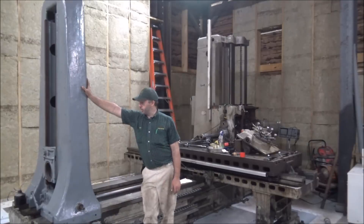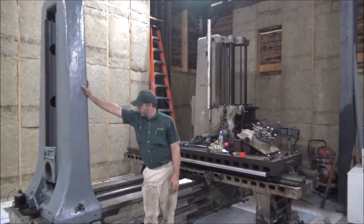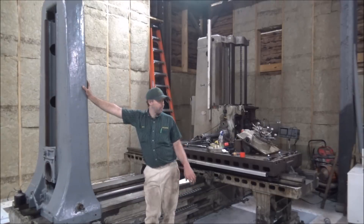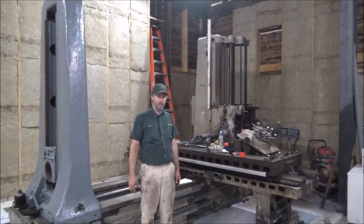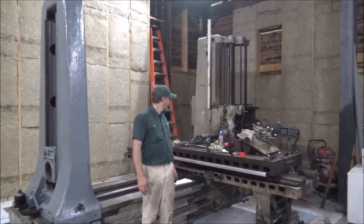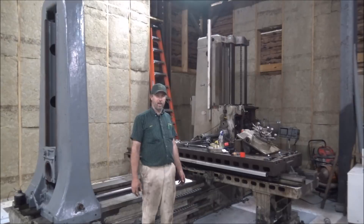I have to say I like the way it looks with the tailstock on here — it definitely gives it more of a proper boring mill feel. Now I've got to find some big pieces of steel to make some boring bars out of. I need like some four and five inch diameter bars that are ten foot long to build boring bars out of, put cutters in and things like that to manufacture for line boring on this machine. So if anybody's got any scrap hydraulic cylinders laying around that would have rams that kind of size that I could use to build something, that would be great.